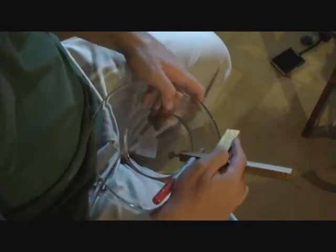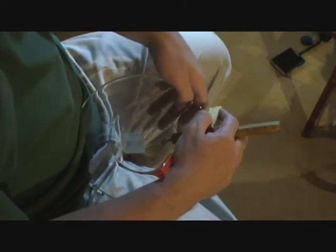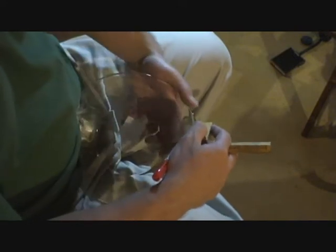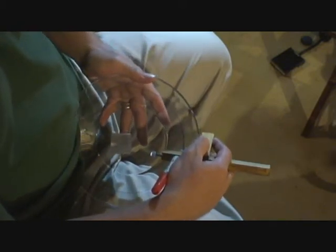Let's say you have a plate and you want to do guidelines on it. You're going to take the marking gauge just like this, put it on your plate, and then bring it down. You can either spin the plate, spin the marking gauge, or both. Go around slow — it should go all the way around pretty even so you have a perfect line that matches on the other end. You can see the baseline I just drew.